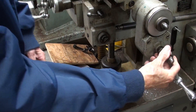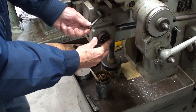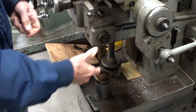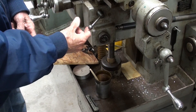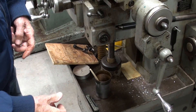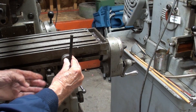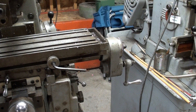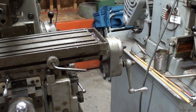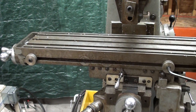I'm going to push this back in so you can see what's happening here. This little knob will change directions — it's moving the other way now, so that's your direction control. That's your on and off. And this is your stop — you have one on the right and one on the left. They can be moved into different positions so that the power feed will trip off. No harm will be done. It's important to set both of those stops when you're using the power feed.